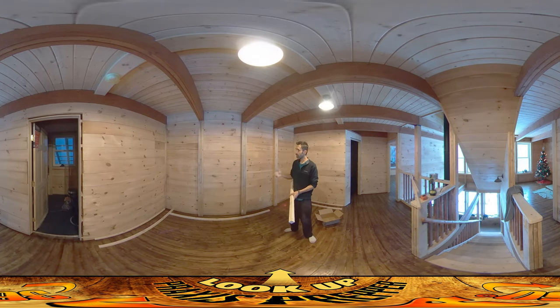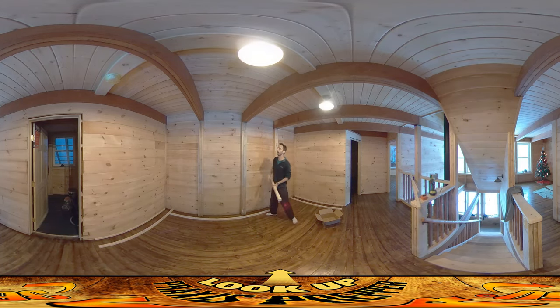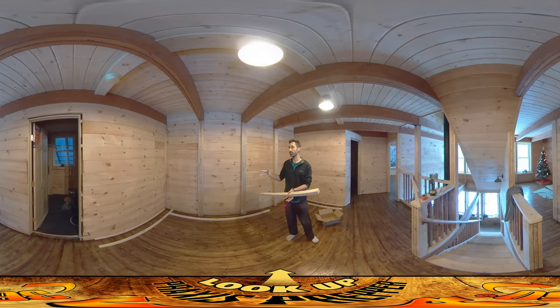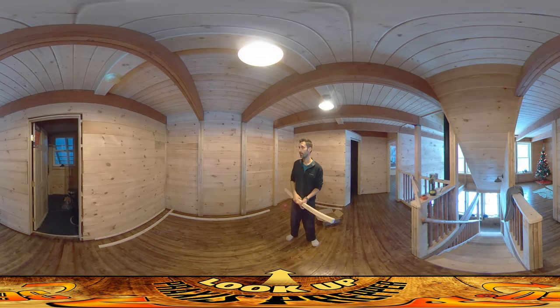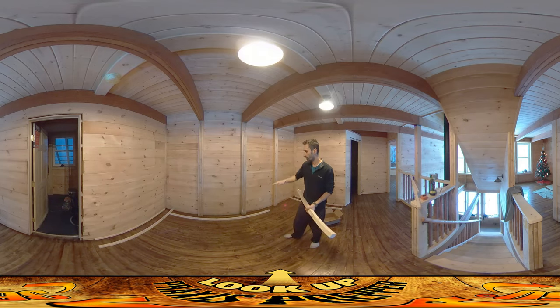If the shelves are too high you're wasting a lot of space, because a lot of books are pretty short. Based on our library, I'm going to have two shelves — the bottom and the second from the bottom — with a 14-inch gap. I'm actually going with 15 inches minus the three-quarter inch board, so it's 14 and a quarter inches for the first two shelves. All the shelves above that are going to be 12 inches — again 13 inches between shelves, so minus the three-quarter inch board that's 12 and a quarter inches per shelf — giving me seven shelves high up to the ceiling. I like to organize books not by height but by topic, so keeping short and tall books on gardening together, for example, is why I'm going with 14-14 for the bottom two and about 12 inches for all the rest.